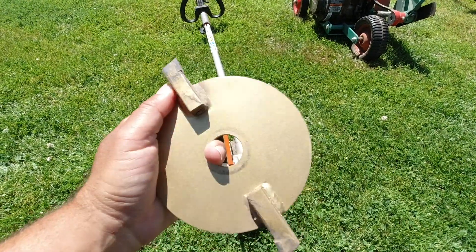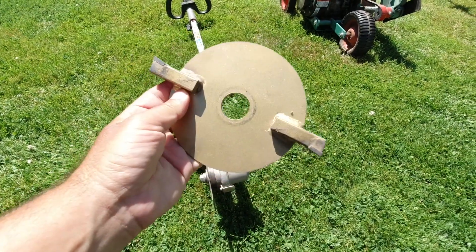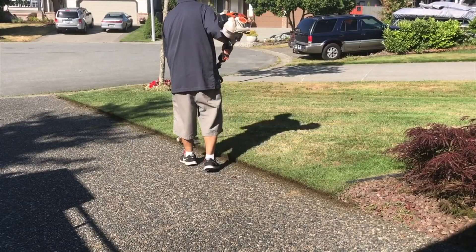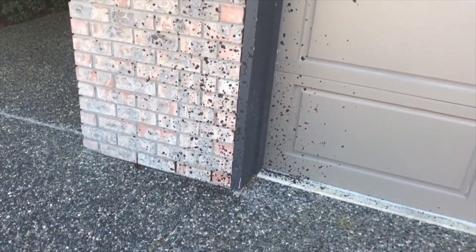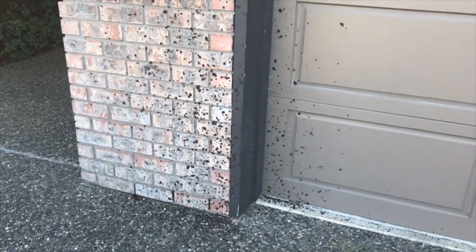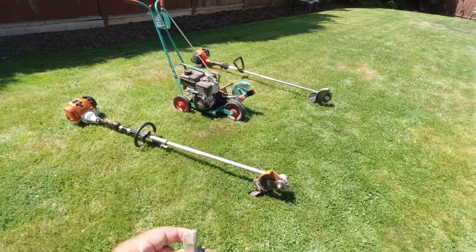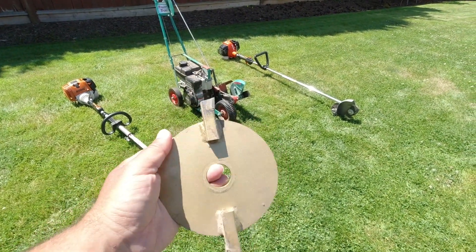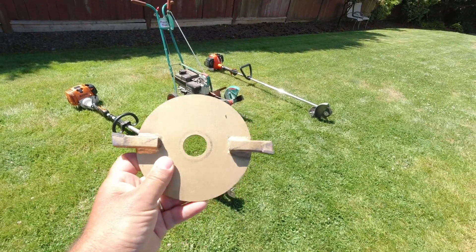The difference with these is that you can see how thick that is when it's going to be cutting — it's going to leave a lot thicker edge. That is again personal preference; you may or may not like the look of that. Comparing the thickness of the Golden Edge versus a stock blade, the Golden Edge is so much thicker. It gives it an entirely different look. I don't care for these just because of the amount of debris that the thick blade shoots back, which makes it a liability in my eyes if you're working in very small, tight neighborhoods with lots of cars and people around.